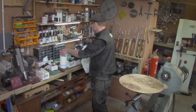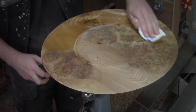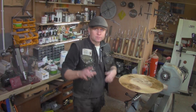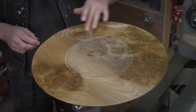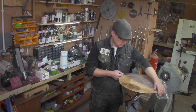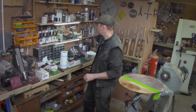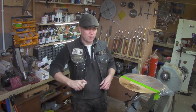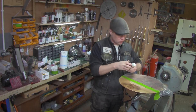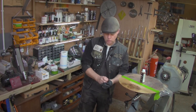I'm not going to put a coat of oil on this side - I'm just going to go straight in with a sealer and then apply it. For this step I want to mask off the really, really pretty part of the piece. I've got a large plastic Ziploc bag and I want to mask off that much of the piece because all of this is going to change. Now I'm going to use the rusty paint - the metal effects paints on this. Although a lot of people who use them don't use the primer, I'm going to, because I do want to have as smooth a surface as possible onto which to put the paint.